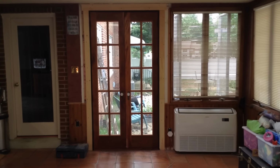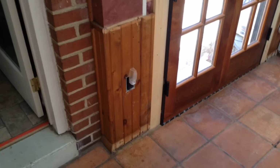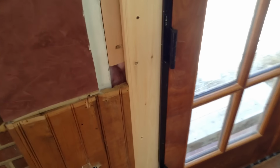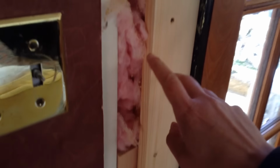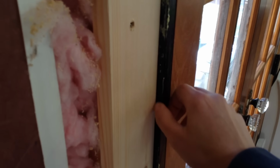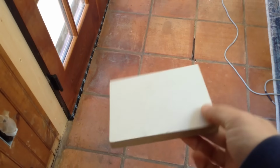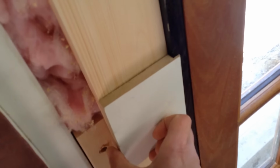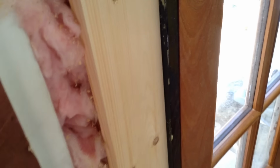The inside of this room is getting completely remodeled, so I'm leaving it as it is now. I reattached the bottom piece of material, and you could see how I originally wanted it lined up, which I calculated for, but because that OSB was off, my frame is sticking in the room a little bit further, which is fine. I'm just going to need about a 1/4 inch packer on top of this 3/4 inch board. I thought of doing a rabbet on my moldings to account for it, but I don't really like the way it looks. So once it comes time to do this room, I'm just going to put a 1/4 inch packer on top of that, and then put all my moldings on top of there as well. So that was kind of how I dealt with that OSB being messed up when it had some water damage.